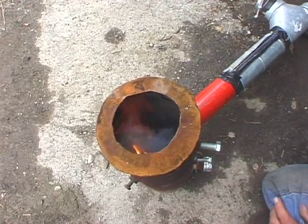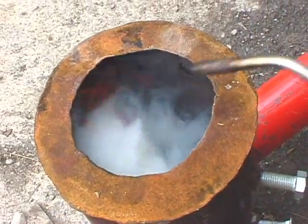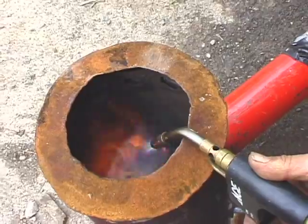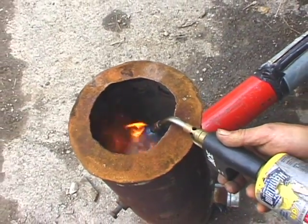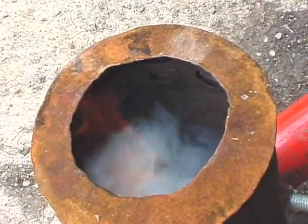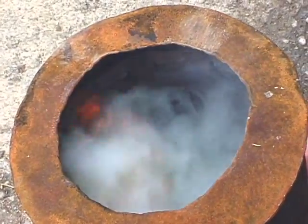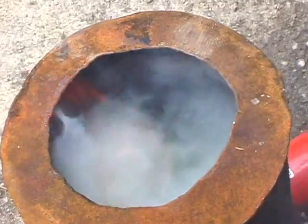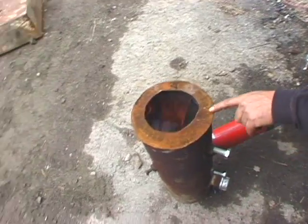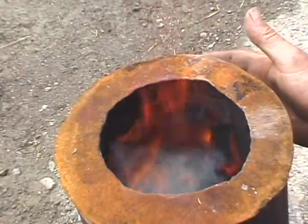Alright, we're running. Look carefully — there's smoke down there, and the secondary air is mixing up here around the ring, and we're getting combustion up here. We need to get it a little hotter for our secondary air. This temperature has to come up a bit. It's starting to go now — see how the smoke is burning off, and we've got ignition up on the top. You can see how it's igniting nicely where the secondary air is mixing in.